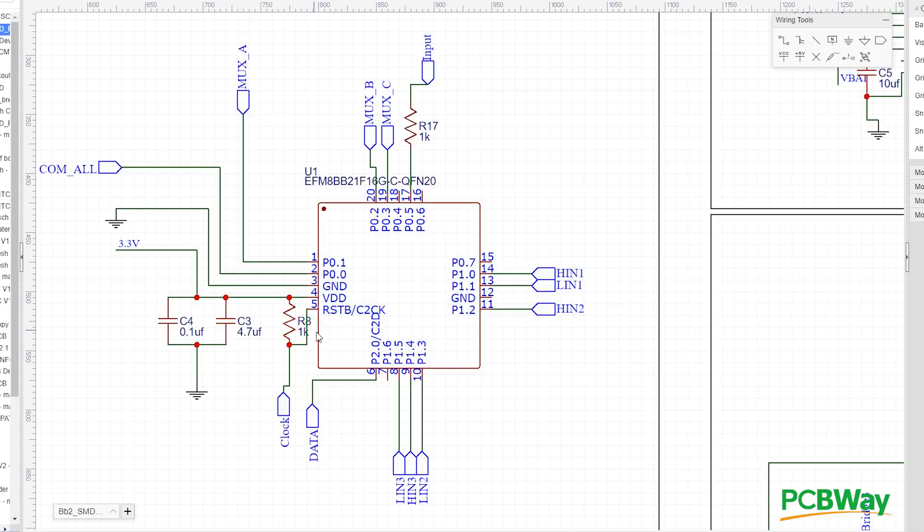We also see the clock interface — think of it like a USB input/output to program the chip. You have the data line and the clock which syncs everything together, along with a pull-up resistor to prevent false inputs from board noise. All of this is set out in the official data sheet, so I followed exactly what they recommend.